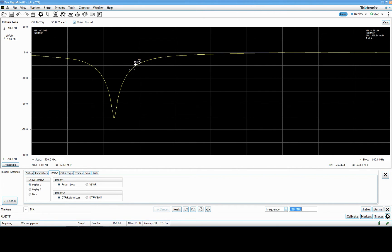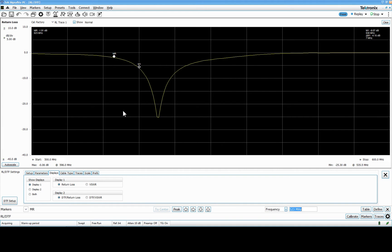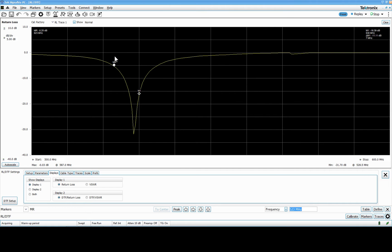I'll use the first antenna as a reference — I'll put the right marker down here. At 523 MHz this is the sweet spot for this antenna. I'll use this soon to generate an RF signal over the air for some simple measurements. Going back to my other antenna: the marker reference is tuned at the sweet spot of the first antenna, and they're a little bit off. What you can do in this case is bend the antenna a little bit, and at one point when it's bent we will end up in almost the same sweet spot.